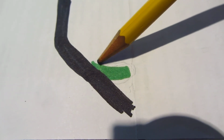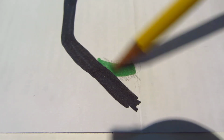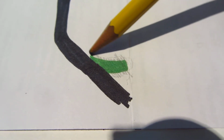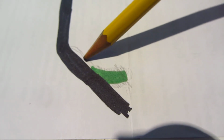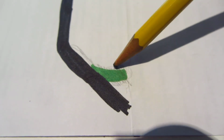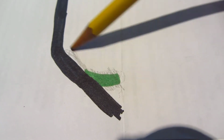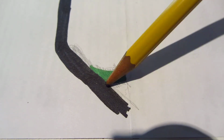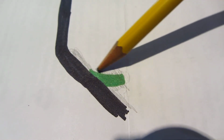And I believe what you're needing to do is grind all of this down to where you are now able to just have a smooth surface, and then you're going to want to rough up to around 9 inches up from there, wherever you're going to bring the new fiberglass up and attach it to the old. So you'll be roughing up about 9 inches up this surface, and then probably also 9 inches down this surface. I'm not sure about that part actually, but certainly up the surface, because when you put the new plywood down here,